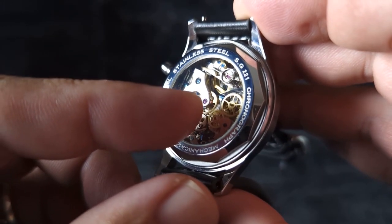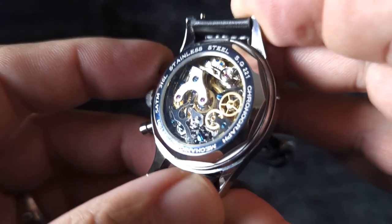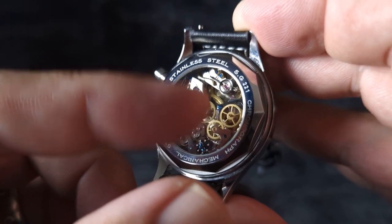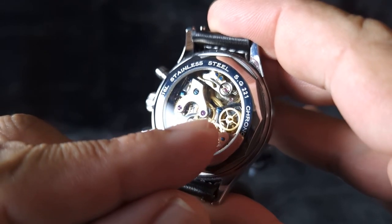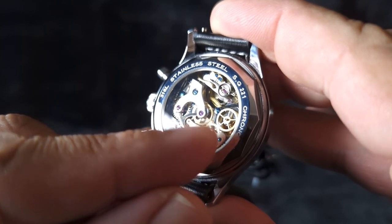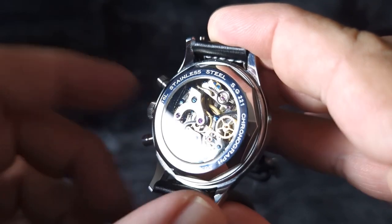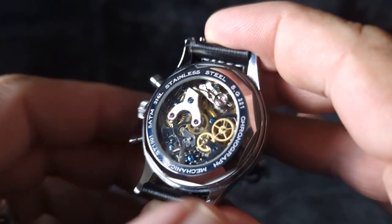Now it's kind of difficult to see, but there's an odd shaped bit of metal that's attached to that center wheel. And what happens is this arm comes in here and pushes on that, and the shape of that metal causes the hand to go straight up. There, you can see part of it right there, right near the light there. So when this comes up under it and pushes on it, the smallest part is down here at the bottom, so it forces the hand around. And it's shaped to where no matter where that hand is, it comes straight back up.